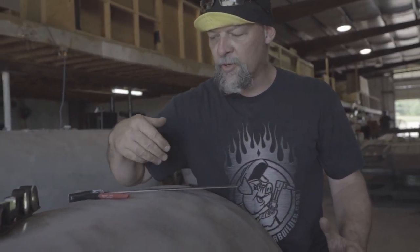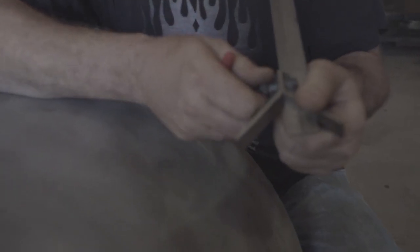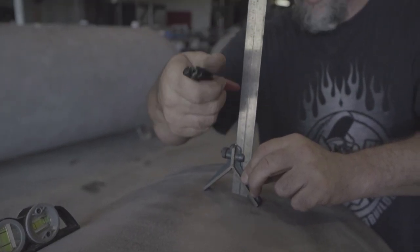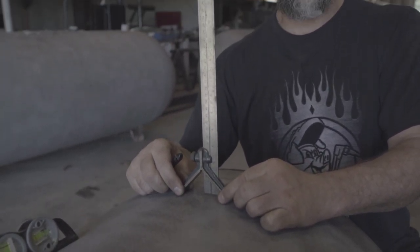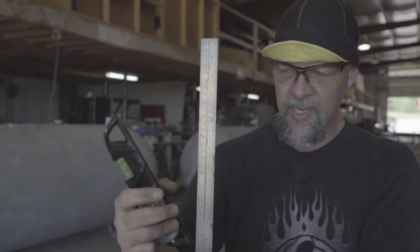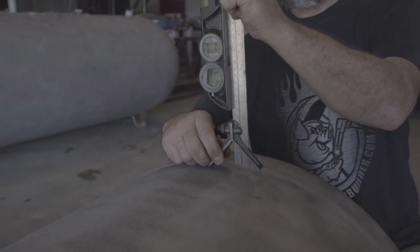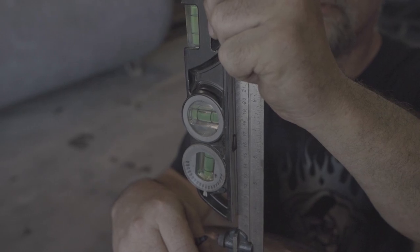The way this works - this is called a center head square and it's for finding the center of a round surface, the top dead center. You can turn it and this edge right here is in the center of the V. That gives us a really good indicator of where the center of this thing is. Now all we need is a way to tell where we are vertically. So we take this torpedo level - I like to make sure this ruler here is steel, and there's a groove in the middle of this level with magnets. That way I can hold it with one hand. As we move, that bubble's going to tilt, and we just rotate this up until that bubble is dead center in that line.